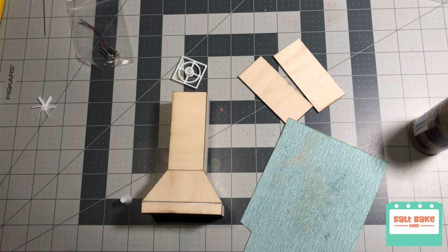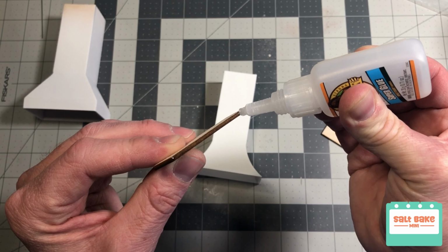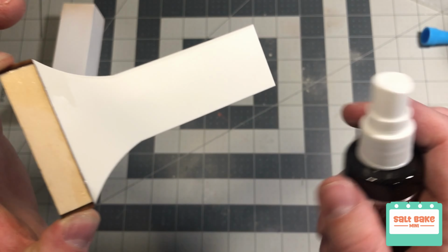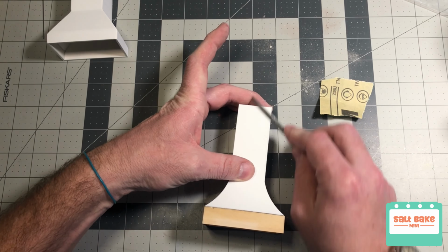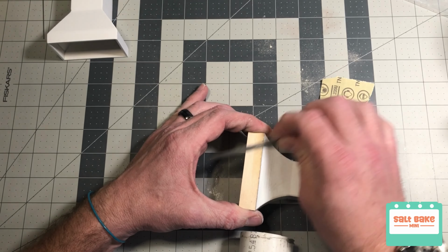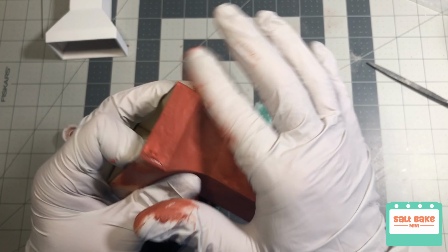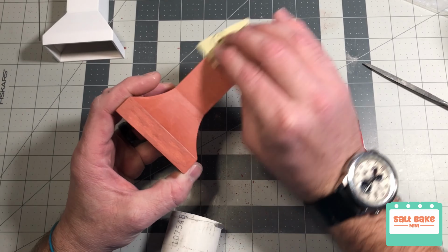I made a hood fan for the oven out of wood, and after painting it, decided I didn't like this shape. This one has a much better shape to it, and I think it'll look much better. The top part is 3D printed and the bottom will be wood, being a little more heat resistant. I gave it a quick sanding before my favorite method of smoothing 3D prints, Bondo putty. Spread it on, and once dry, it can be sanded smooth.